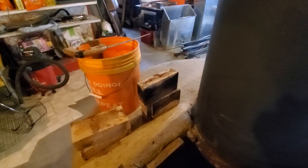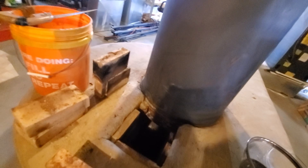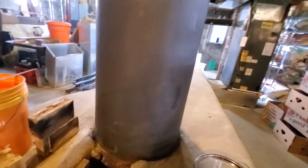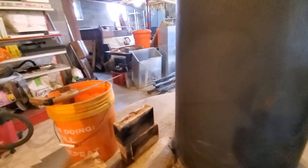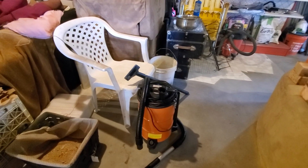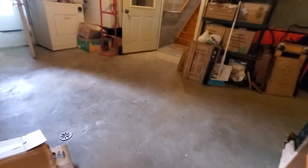So we're going to cut new bricks and rebuild this heater and clean it all out. There's very little ash inside the burn chamber — the ash is very minimal. Got a little bit of soot we're going to clean out from these two clean-outs on the ends. We've got a very useful high-filtration chimney vacuum that's going to help us clean this out, but we're going to come outside first so we don't make too big of a mess.